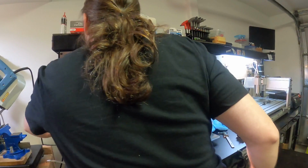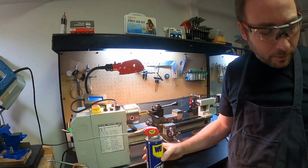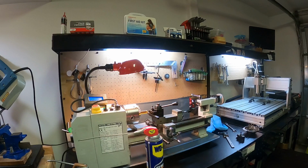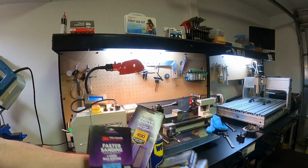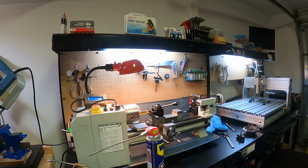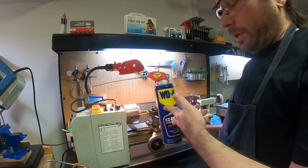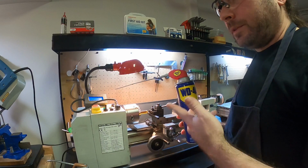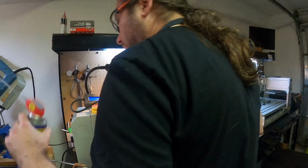And then for things like if you want to use different varying grains of sandpaper, going from maybe coarse down to very fine. So for instance, I have pretty much everything in between 60 and 400 that you can get. And if you use sandpaper going down in grain size, and also WD-40, something very, very slippery, you will end up with almost a mirror surface. Like you can make a mirror surface on aluminum doing that just with sandpaper and WD-40.